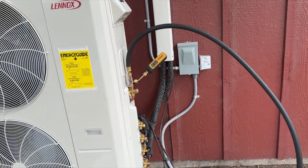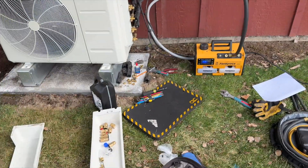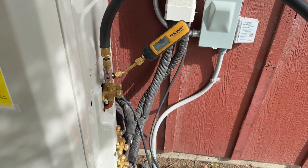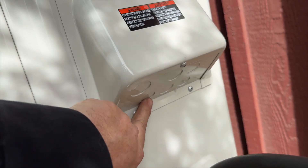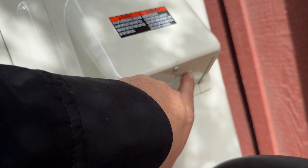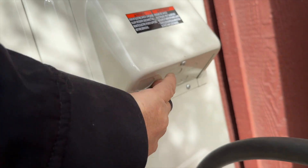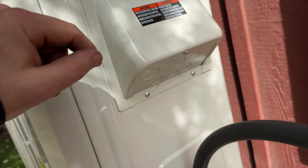I've been pulling a vacuum now for about two minutes and we're already at 630 microns. This new pump's pretty nice. I'm going to go to lunch and come back — it'll probably be more than done by then. Back from lunch: we're at 380 microns, so we're going to keep letting her run. I'm going to do the electrical — I need to hit these knockouts, specifically the half-inch ones: A, B, and C. I'm leaving the panel on while I knock them out so it has something to push against; otherwise it'll just bend.